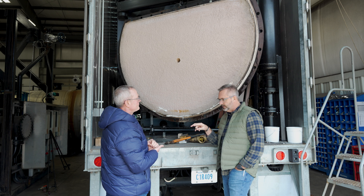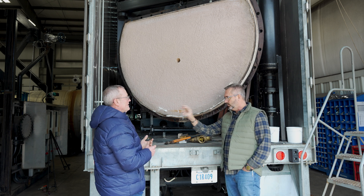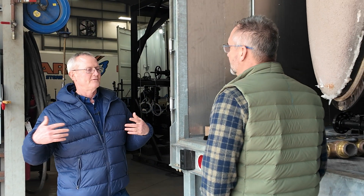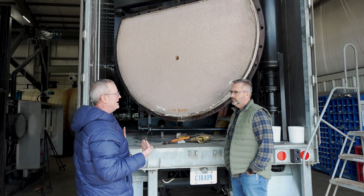You said something about curing two days — what does that look like? Is that just a low fire? No, it's five minutes on, 15 minutes off, for six hours. Then 10 minutes on, 10 minutes off, another eight to ten hours. Then 20 minutes on, 20 minutes off. You've got to have that cool-down time to give that moisture time to evaporate out of there. If you don't give it a place to go, it's going to find a place.